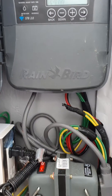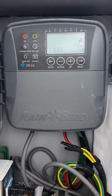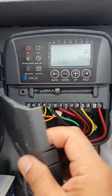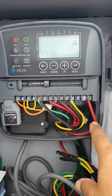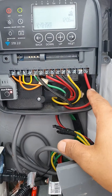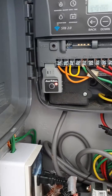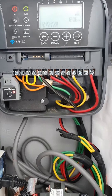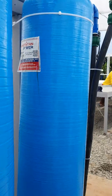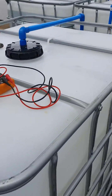In this video we're going to test out the pump start relay that's wired to the Rainbird controller. We set it at channel 8 without a valve, so it'll just automatically turn on directly on channel 8 — one wire at 8, one wire in the common. The pump is a submersible pump in a fish pond to draw water through the filtering system and eventually to the IBC reservoirs in the back for clean water.